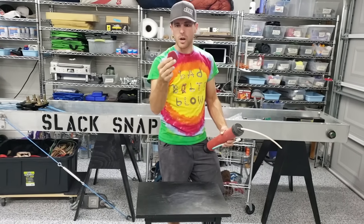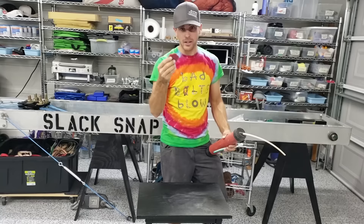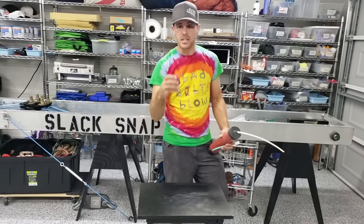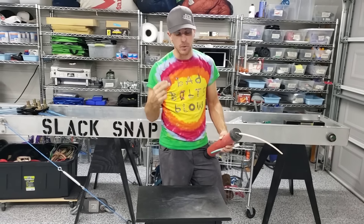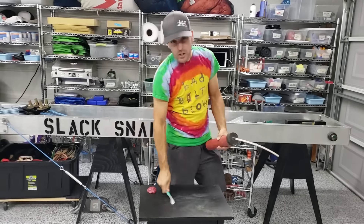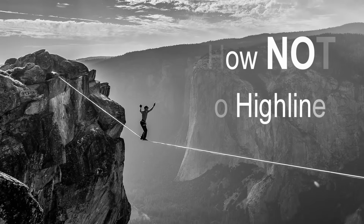This is my leftover glue from a project I did in my backyard — this is the Hilti HIT-RE 500 glue, the really awesome stuff. It's super polished right here. All I had to do was put something dirty on it, goo it up, and when it was dry, pop it off. This is really plasticky, and if it doesn't have a good chemical bond to the rock you're installing it in, it's just going to come out in one tube. So you want to make sure your stuff's brushed and blown a dozen times if you have to, to make sure that hole is clean — and you're not just blowing and you're not just brushing. So check out — we'll be right back.